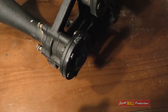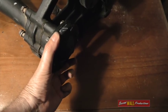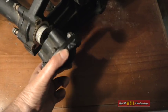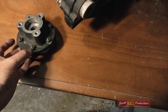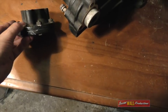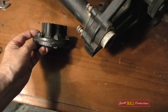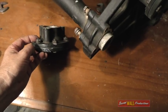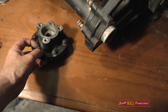Once you've got the three bolts out, you need to gently tap the power chamber so that it slides off the base of the bell. The next step is to undo the six bolts that hold the back cap on and, using a wide blade screwdriver, gently prise the back cap off the chamber. Too much force in this process and you'll crack the chamber and that'll make it useless.